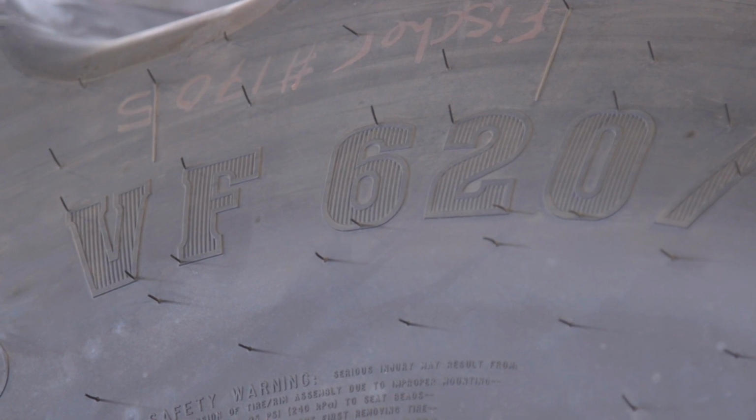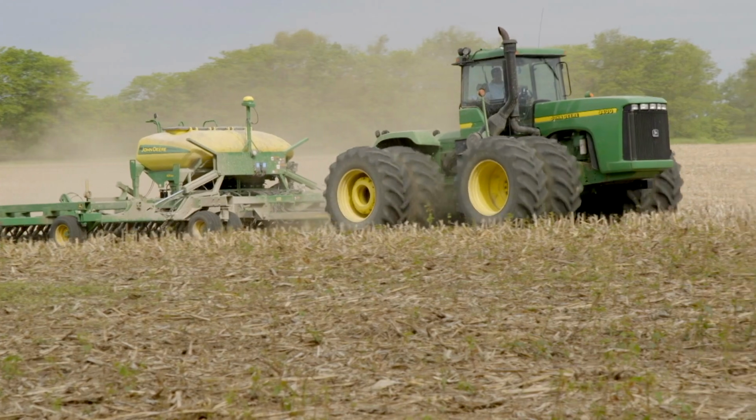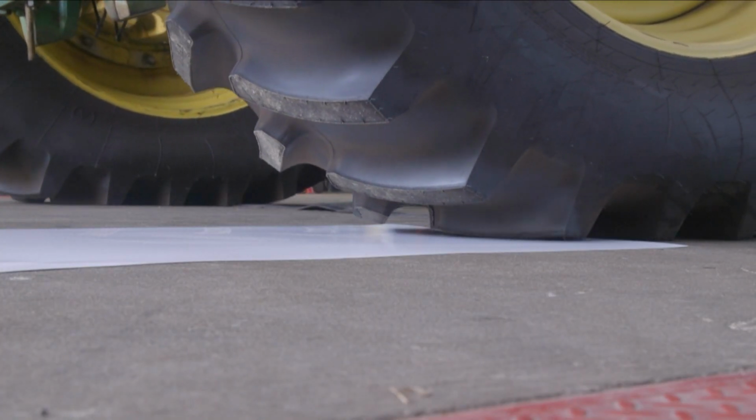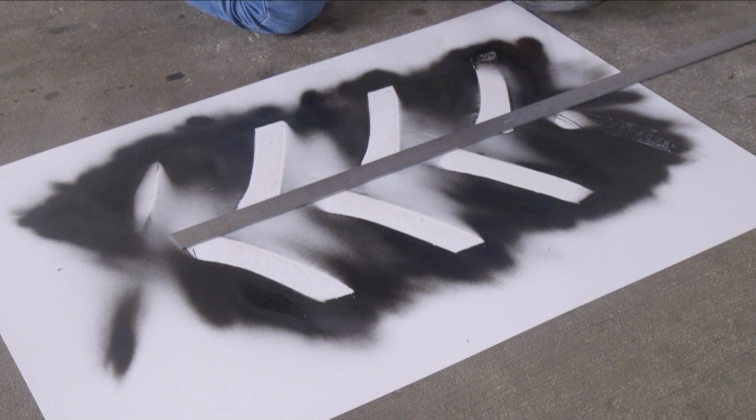Okay. So it's great in terms of load capacity. The other benefit comes in on tractors where we're really looking for lower pressures. We can carry the same load at lower pressures. You have to remind me here, the advantage of running at lower pressures is... Right, as we talk about all this ballasting and carrying this weight across the field, if we can carry that weight at a lower pressure, we're doing a couple of things. We're improving traction. We put down a bigger, longer footprint. The footprint elongates, so that improves traction and efficiency. It eventually yields better fuel consumption. As well, that footprint means less compaction, so a lower PSI translates into a lower ground pressure.